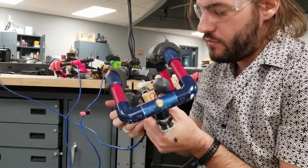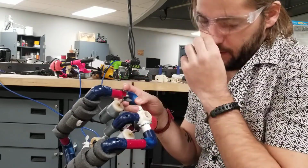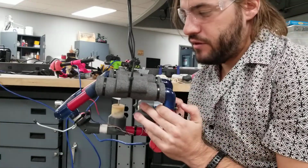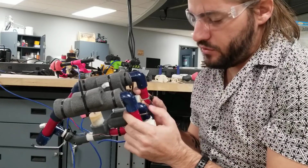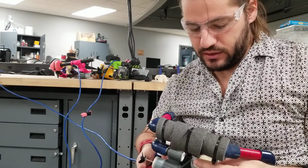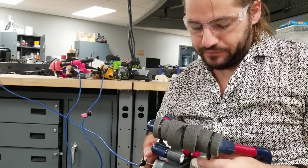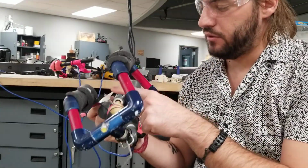This kind of propeller is really good for going forward. It's not as good for going backwards. So it probably won't go backwards very fast, but a lot of times in Seaperch competition, you don't need to go backwards fast. So it's better to have a motor that's more efficient at going forward for the back 2 motors. But for the one that goes up and down in the middle, you see they use the stock propeller, and it's good at going both up and down. So it's really good for in the middle.